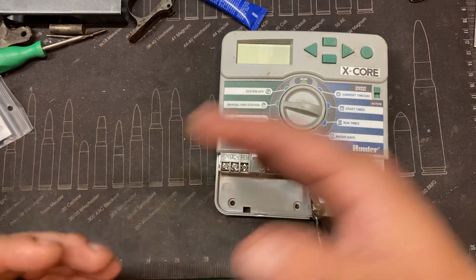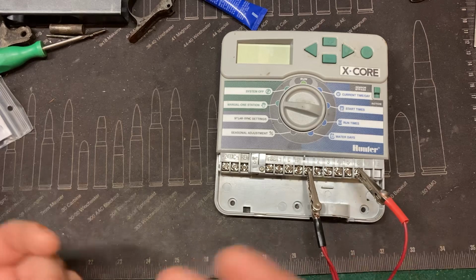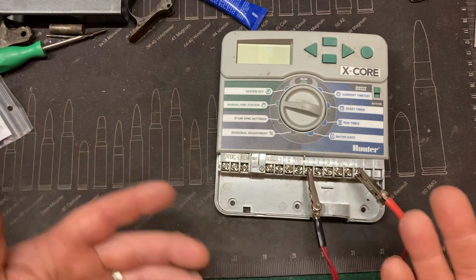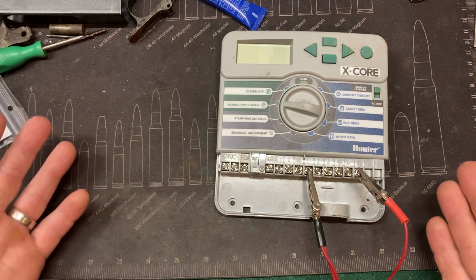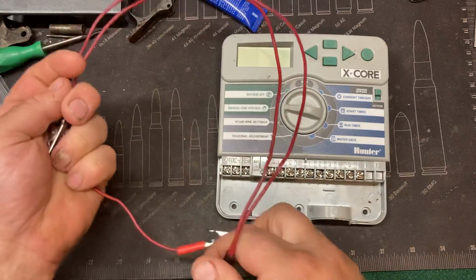And I know each zone, when it fires, it's going to clear because I'm not waiting for water in the main line. So, 3 minutes of zone is usually sufficient on a lot of those commercial ones once I dump the main line. A lot of times I'm not running multiple zones, but I'm going to use them to just dump the main line on a commercial zone. Just handy tips and tricks on your jumper wires.